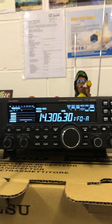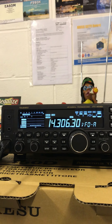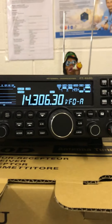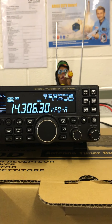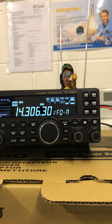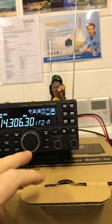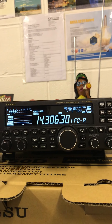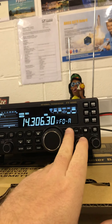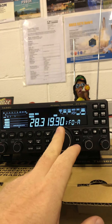These are your band buttons. You have 160, 80, 40, 20, 10, and 6 metres on this transceiver to operate on. The receiving range I think is from 1.4 MHz all the way up to 50 MHz. You can get these radios wide-banded to transmit on more bands if you wish, because it doesn't transmit on CB at 27 MHz as standard — but I didn't opt to get this one wide-banded. This button moves your bands up and down.